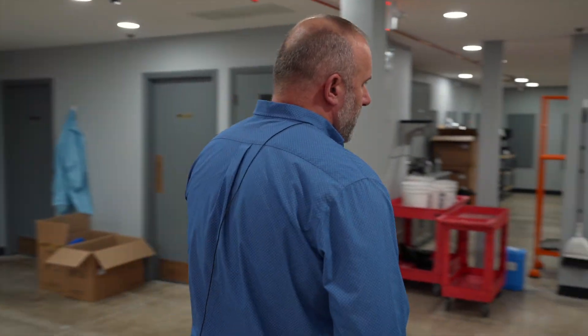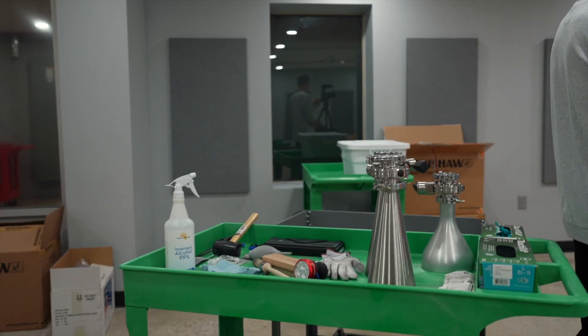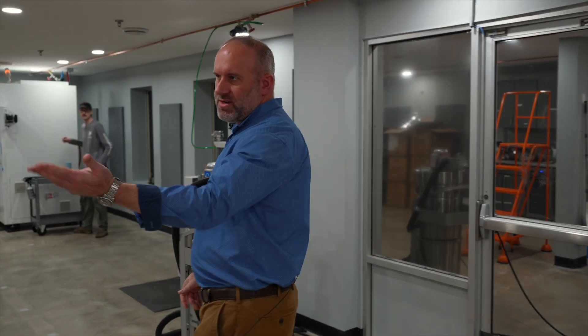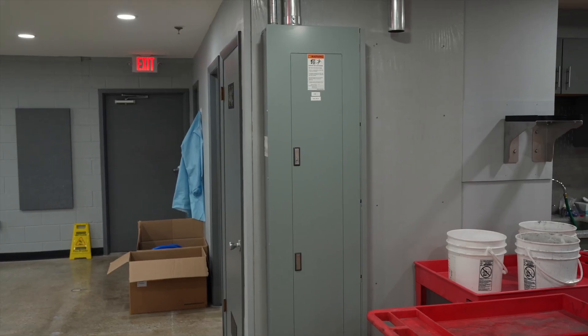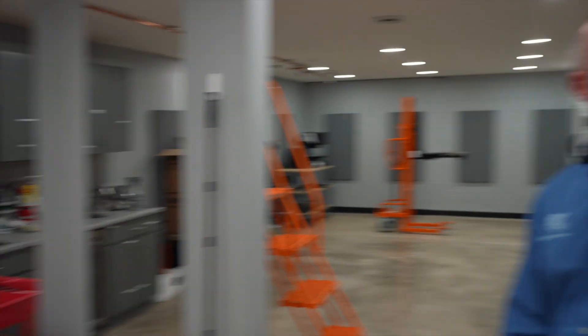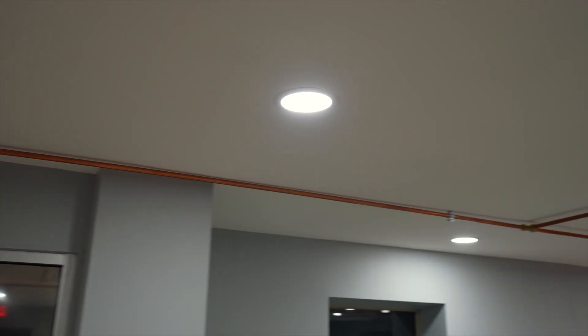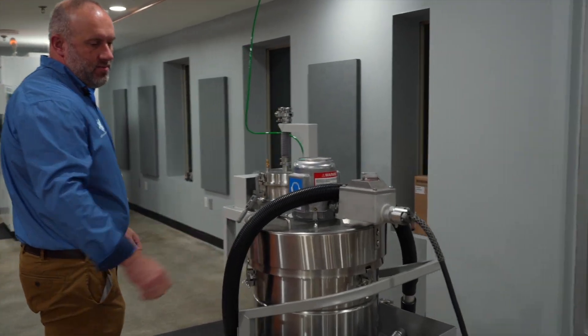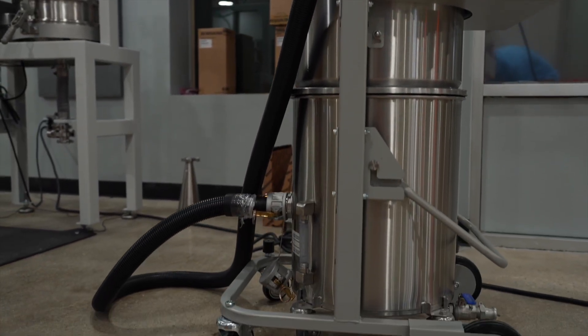Walking around this space, you'll see that the machines have carts that we have equipment for depowdering on. We have electrical panels dealing with the service of the power to the equipment. Overhead we have copper piping taking the processed gas from the liquid argon micro tank outside. This is an additive vacuum for cleanup, so it reduces what they call the ATEX hazard, which has something to do with the explosive capability of powders in an oxygen environment.